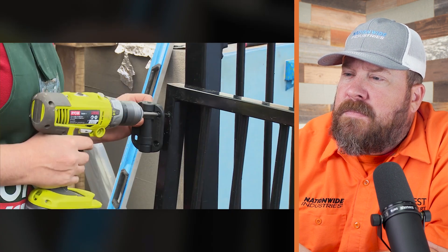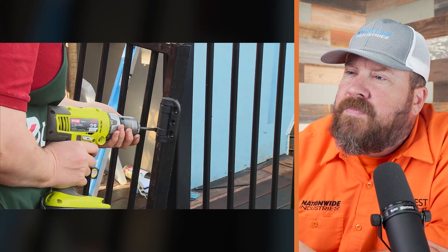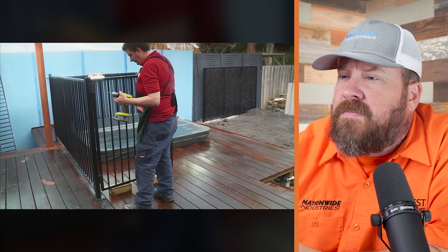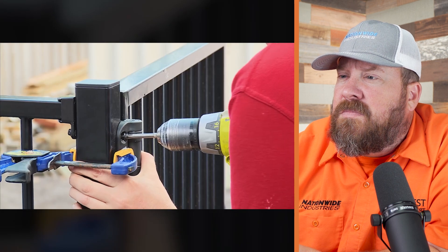Now it's time to fix the gate. They take the hinges and place one at the top and one at the bottom, fixing to the gate first and then to the post. It looks really close to the hinges we like to use — Nationwide Industries makes a Cornerstone 2 hinge that looks really similar to what they're using here. The point of the hinge is it's self-closing. Typically most pool codes require that the gate be self-closing and self-latching, so that if a kid runs out of the pool, the gate will shut securely behind them. Using a clamp to hold the gate in place while screwing the hinges is a really good idea to get it nice and square.